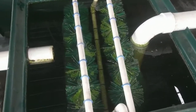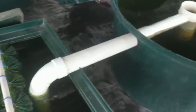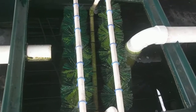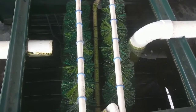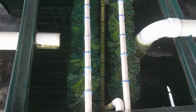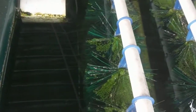The water also then takes a second track. There's a little guard here in the middle to prevent as much solid waste from going this way as possible. This goes to our second level of filtration, which is a brush filter. We have a series of koi brushes or aquaculture brushes that are interlaced. They're made out of nylon so we get a little bit of electrostatic charge, and they're really good at capturing small fish waste — the big swirl filters get the big stuff, and these get the small stuff.